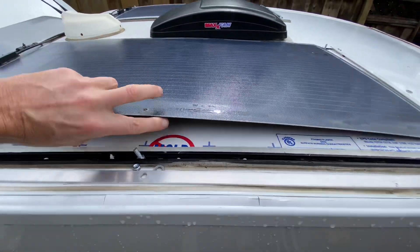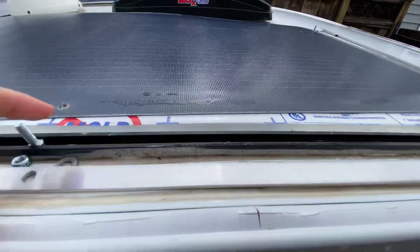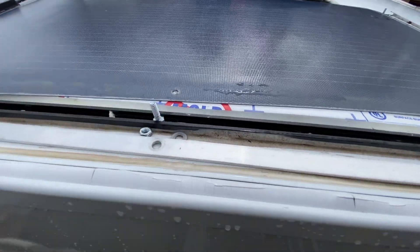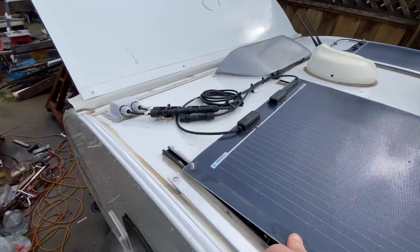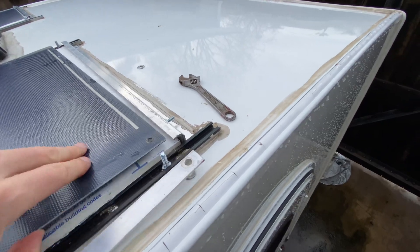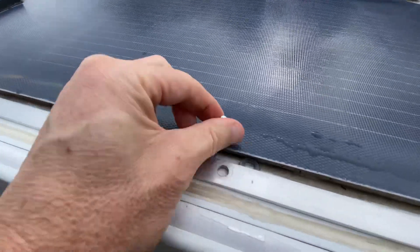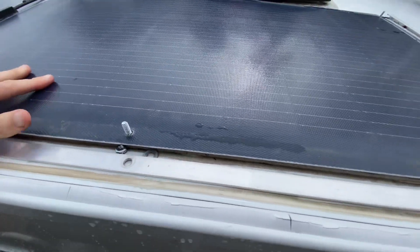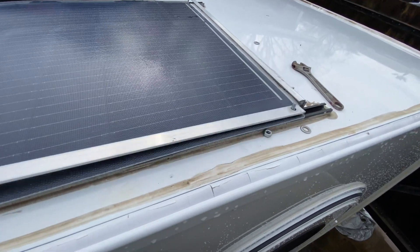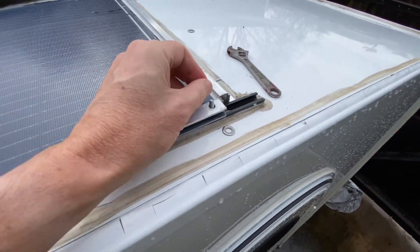For construction, this is just half-inch foam insulation like you'd use on the side of a house, and it fits right to the top of the track. You get these hex bolts which fit in there and slide. This particular panel has a grommet on all four corners — already drilled. I removed the grommet so my screws would fit, and then I drilled one additional hole in the middle. There's no wiring in there — it's all just fiberglass. Then you can slide it up into place.